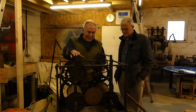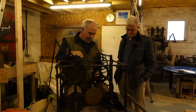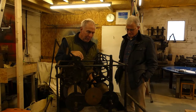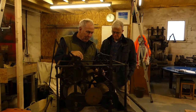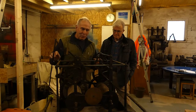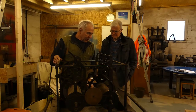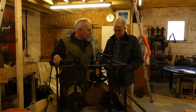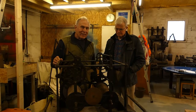So what do you intend to do? What we intend to do is get it all cleaned up so we can see exactly what we've got. We need a few new gears where there's a couple of bits missing so that we can set the time. And then we need several new bushes and then just take some of the packing out and make sure it all works properly. Treat all the wood with wood preservative and then paint all the steel with a satin black sort of finish. That'll look like it would have done when it was made, originally.